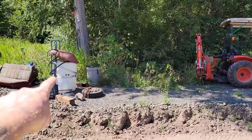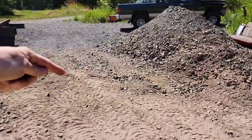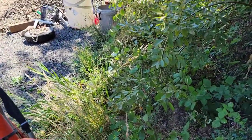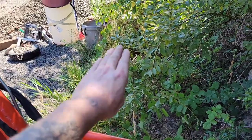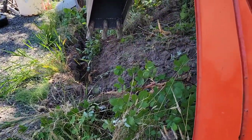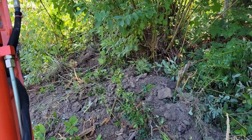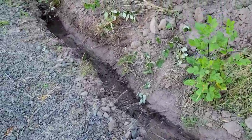In order to keep this area drier, I'm gonna come up here and dig this trench much deeper all along here so the water flows this way. I'll put a pipe across and down to my little culverts. Had to move all this stuff out of the way — part of collecting junk, but I like things for future projects. I'm gonna start with the backhoe and just start digging along here, getting it a little bit deeper and sloping it that way — a little bit deeper at this end. I'll keep putting the dirt off to the side and mash it down so it doesn't all end up right back in my ditch. Water's flowing nicely, checked it out with the hose.